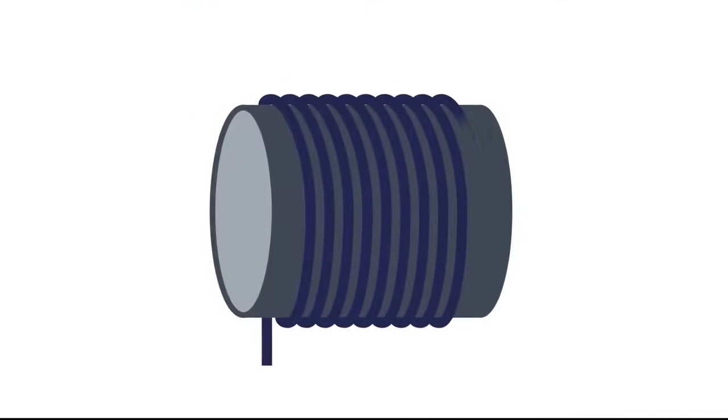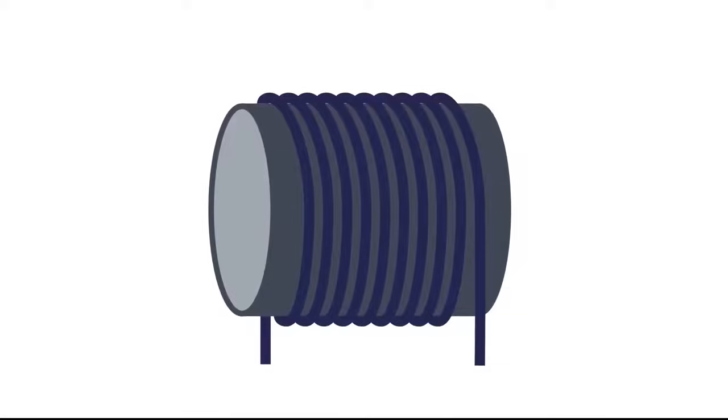The magnetic fields combine to make a stronger field around the conductors. This is why there are multiple coil turns on induction coils — it results in bigger and stronger magnetic fields next to the material being heated.